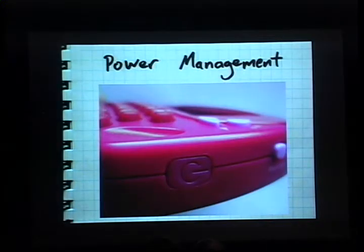It turned out that of all the work I did on this little pocket spectrum analyzer, the hardest part of the entire project was getting the power button to work. This device does not have a hard power switch — it has a soft power button you can see on the side of the unit. It's just like one of the many keyboard buttons on the front, just a multiplexed general purpose IO pin pair.